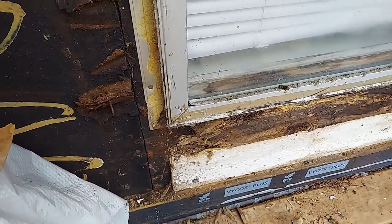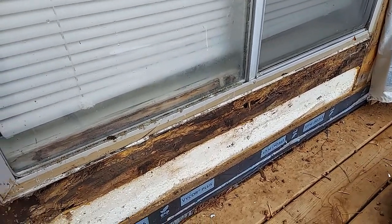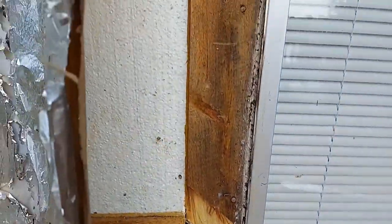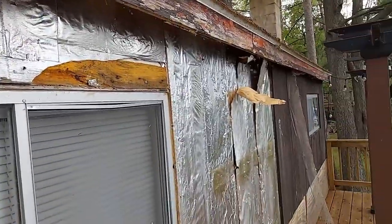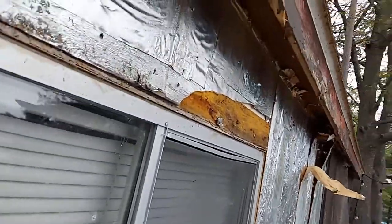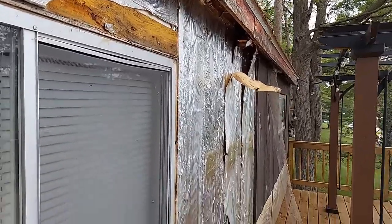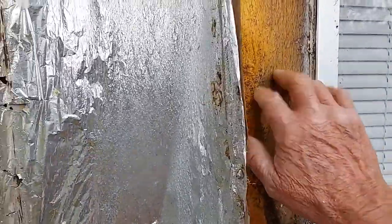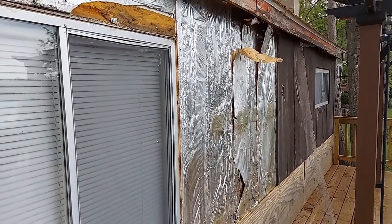That's good to see, though it'll be a little more work to get it out than if it were a replacement window. As you can see, I'll have to continue removing the wood — this was rotten. I knew it was rotten last year, and that's part of the reason why this project needed to take place. We decided to go ahead and put a glass sliding door in place of the window. I'll have to remove all of this old house wrap, and for some reason they put wire lath in the eave, but it's completely closed up.